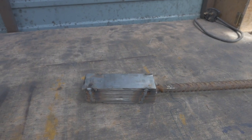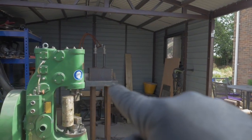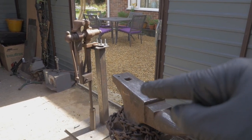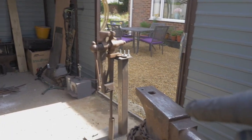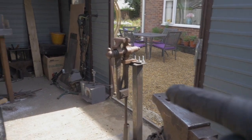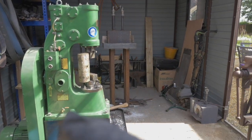I'm going to take a quick break, then come back and turn the forge on. Then I'm going to heat it, put some flux — some borax — onto it, and hit it with a hammer. I'm going to do that three times: forge to anvil, forge to anvil, three times. Once that's set, I'll turn it on its side and hit it on the other side to make sure it doesn't split, then go on to the power hammer to flatten and stretch it out.